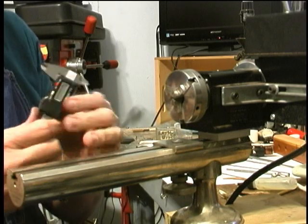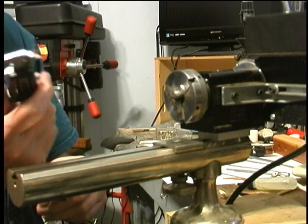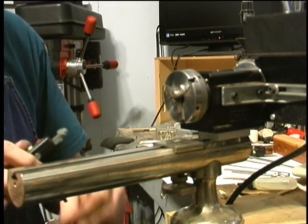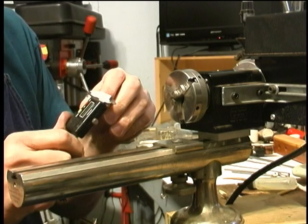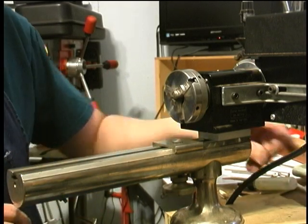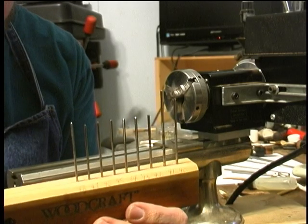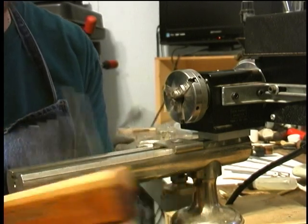Any decent repair shop's going to have some sort of fancy measuring devices. These are rather cheap. 20 bucks will get you one of these calipers. This one's both metric and inch. I'm going to measure this rod and see what it is. It measures 77 thousandths of an inch. I've got a set of reamers, precision machinist reamers. Any machinery supplier has these. J.L. Smith and Company has them, one of our main woodwind suppliers.